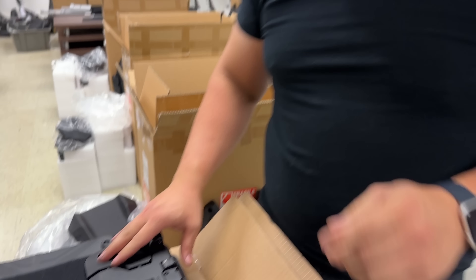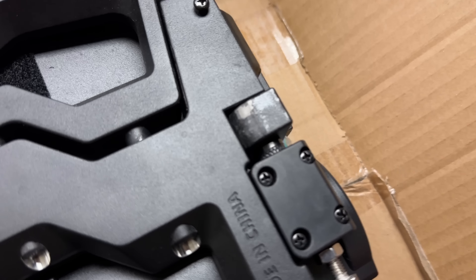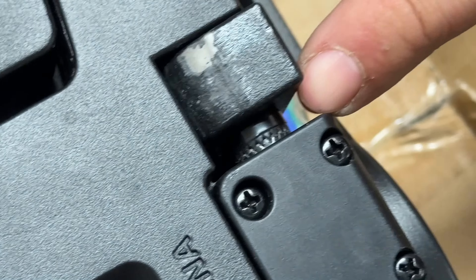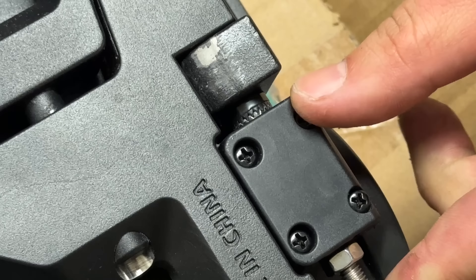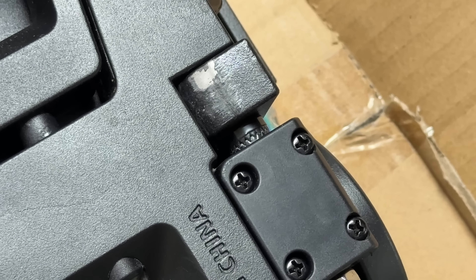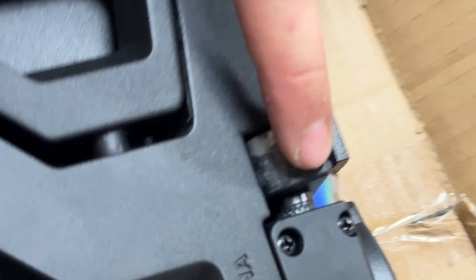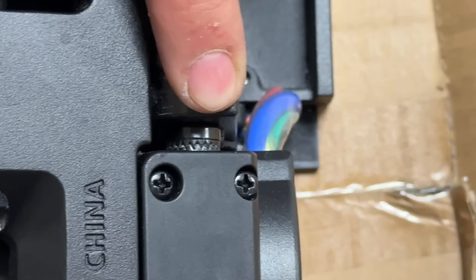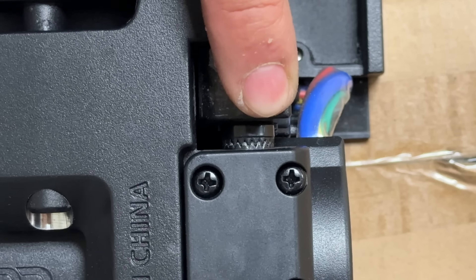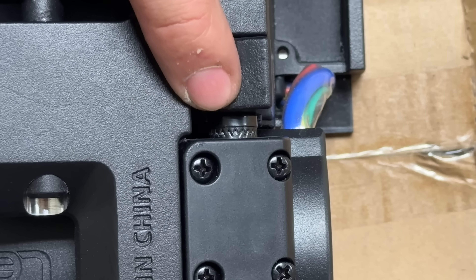As we're kind of wrapping up here — I don't think we talked about this on video — but these teeth here, this is what creates the ratchet. If you tighten or loosen the screw, this should be the spring — so that controls how strong or weak you want it to be. As I move the pedal, you can see how it kind of goes in and comes out, and that's what creates that clicking sound. But if you can see, what used to be black is now silver — it's going to wear over time. This is only four days of use.